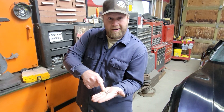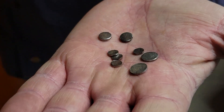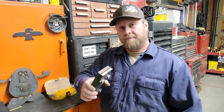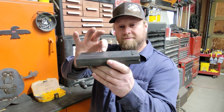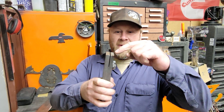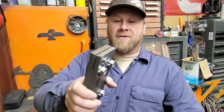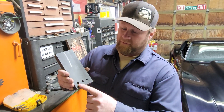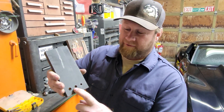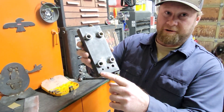Here are the perfectly round patches in various sizes that you can create. This is our punch block that we've made out of a piece of one-inch flat bar. We made a cut right down the center with a six-inch cutoff wheel on an angle grinder, then drilled a 3/8 hole, 5/16 and quarter inch hole all the way through on the drill press.